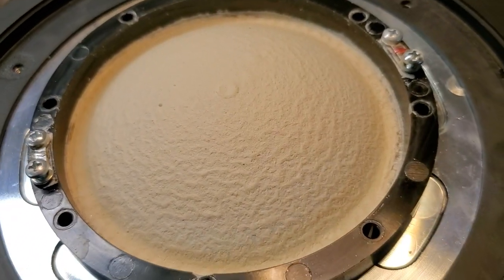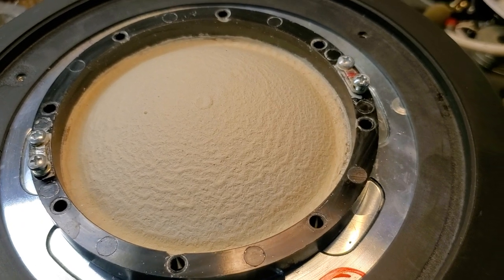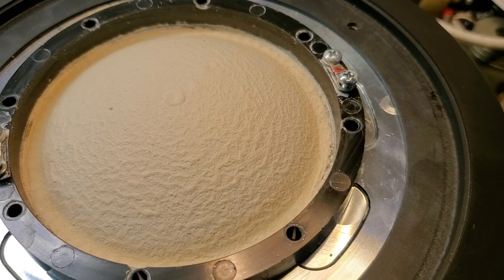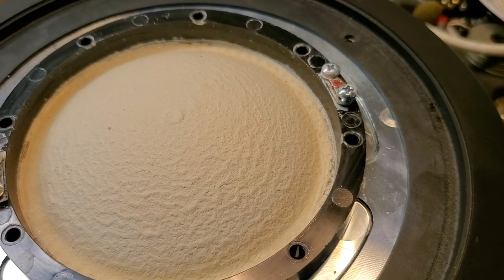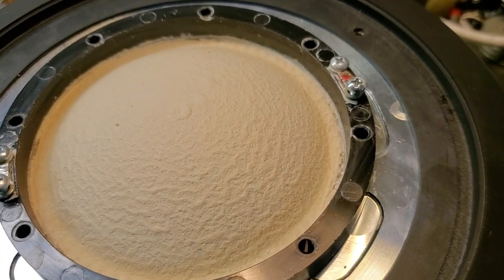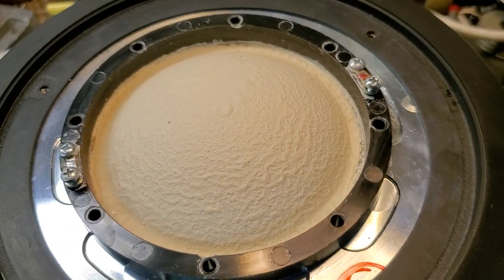When these are on the sweep generator, sweeping from about 500 Hz up to 16,000 Hz, at around 14,000 to 16,000 Hz — just like on the one-inch drivers — you can hear a secondary resonance an octave below that is louder than the fundamental frequency. So you hear 8,000 Hz over the 16,000 Hz. That's what gives it that edginess, that 'cuts through' quality — but what's cutting through is actually distortion.